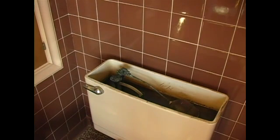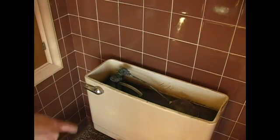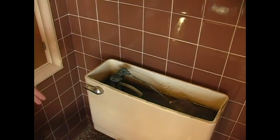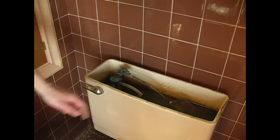And you don't have to worry about it corroding too much because you don't put in this acidic mixture very often. But you pour that down in there, and that clears out any lime that's down in the insides of the toilet where any minerals have developed that were dissolved in the water, or any rust. So don't forget to drip a little bit down in there, probably about a cup.